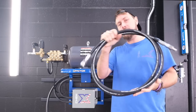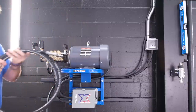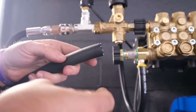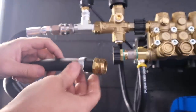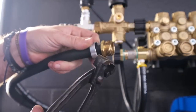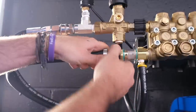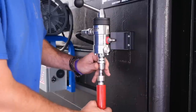So this should really be a huge time saver. The real deal valves come with a 10-foot jumper hose — that's to get you from the outlet of the power washer into the inlet of this valve. I'm going to run this right behind the machine, nice and clean. I've cut off the end of this garden hose and I have just a new garden hose fitting to put on here — I like to keep everything real clean. This is an Oetiker clamp — a real nice way to crimp a hose end on. It holds on really good. That's a size 25 Oetiker, and I believe this is half-inch garden hose. This 25-foot hose is going to go from the outlet of the real deal up to the ceiling boom.